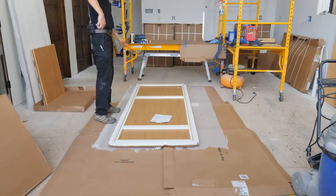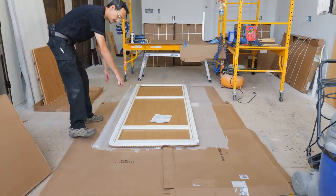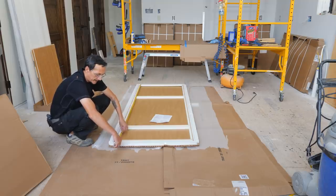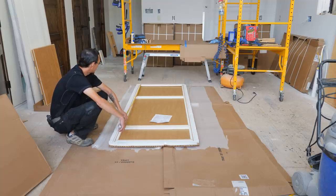The custom sized case only cabinet, which is for our wall microwave combo. This is 86 inches tall, the face frame is, and then you add 4 for your toe kick, which gives you 90 inches, which is 7'6".